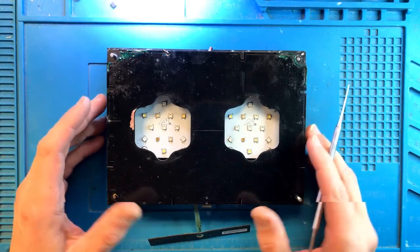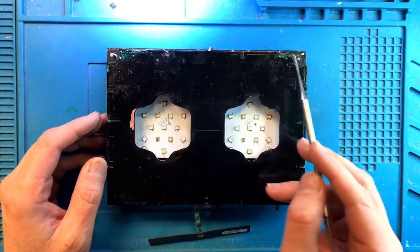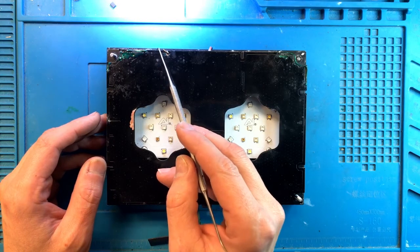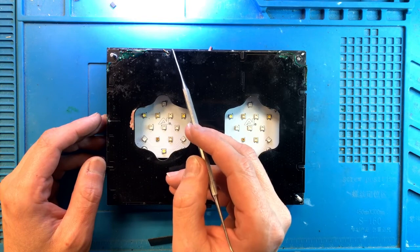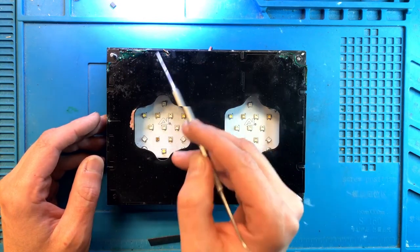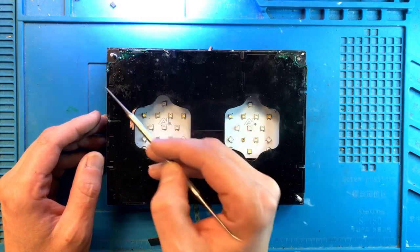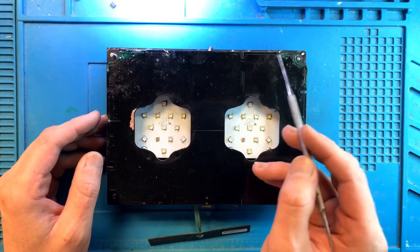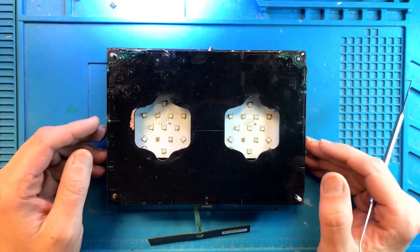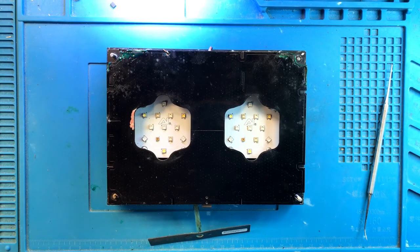All right, so I partially assembled the light. I found a couple more issues while testing it. One was that both vias on both ends here, where there was a short and part of the board got damaged, the vias also got damaged on this main rail that goes to each of the LED channels. So since each of these vias didn't conduct, power was not coming towards some of the channels, and there was a short, so I had to clean this up, and I had to run a jumper wire as well from the outside over to these parts of the LED channels. So two of them had to be done, a little bit of cleanup here, which I will still need to conformal coat, and otherwise the light should now work. Let's plug it in, see if all of that effort resulted in a working light.